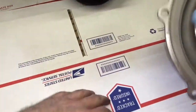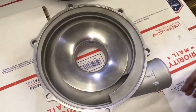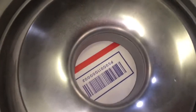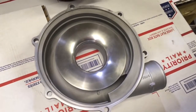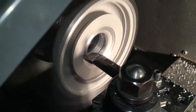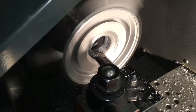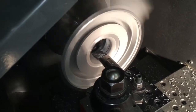The problem most machinists have with this cover is that they're extremely warped when you get them. The reason is that they're a two-piece housing pressed together and extremely thin. You want to line up the best you can, then surface the flange where the bolts mount to the seal plate. It's also a good idea to machine the silencer area just enough so you can grab the compressor housing on the inside with the three-jaw chuck, which lets you grab the housing more accurately than grabbing the outside, because they get so badly warped.